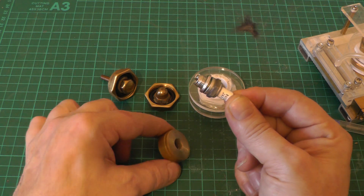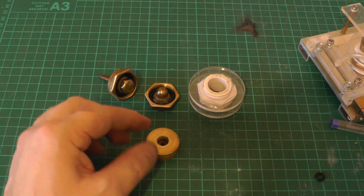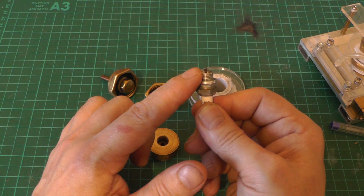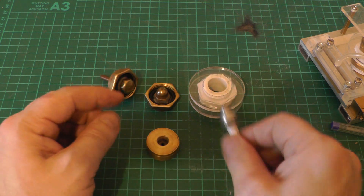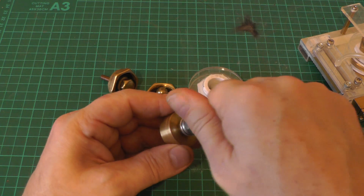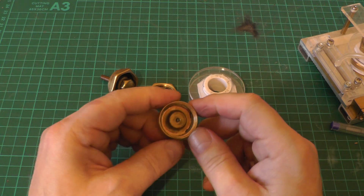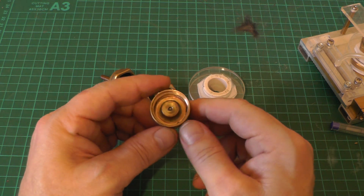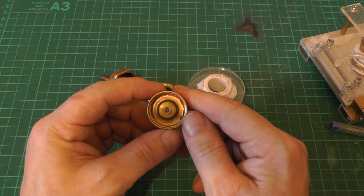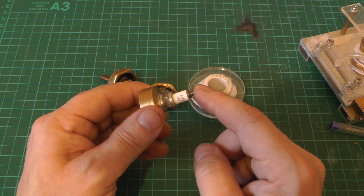For the trigger electrode, why mess around with epoxy when I can use an off-the-shelf component? I have a spark plug here — all we have to do is trim off the original spark gap, which I also did on the lathe. Now we've got a trimmed-down spark plug with the center pin projecting from the end. There's a little O-ring and we can assemble the cathode side of the gap. We've got the O-ring because we're going to be pressurizing this, and we should be able to see the center pin in the middle of the cathode.